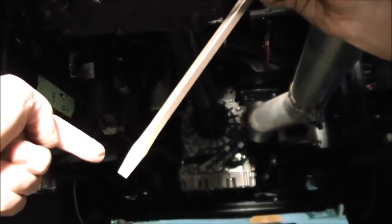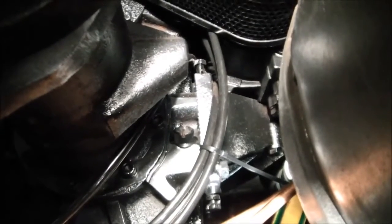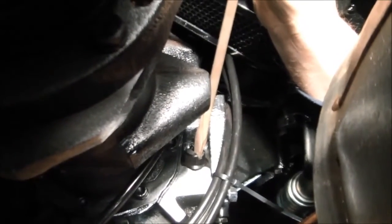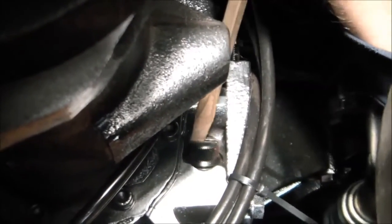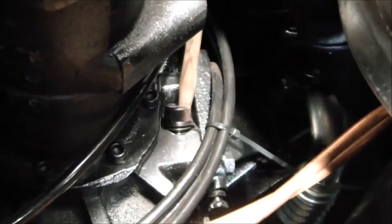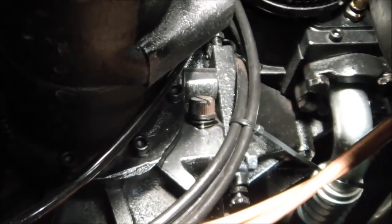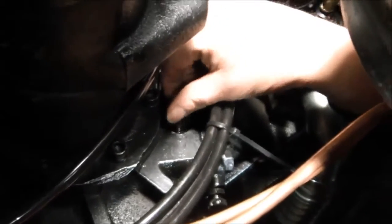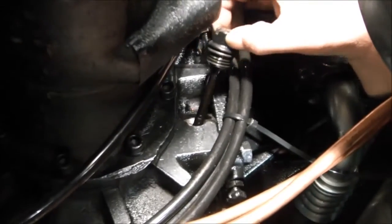You can see here I'll zoom in on that knurled dipstick nut. You'll need to get a large flat blade screwdriver and come in from the top side and loosen that dipstick bolt, turning it counter clockwise to remove it. The dipstick is sealed by an O-ring, so once you remove it you'll need a shop rag handy to check the level.